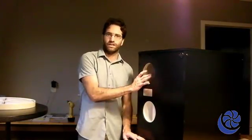So that installation dictates that you wire from the furnace control, the go signal for the fan on the furnace, to the RecoupAerator, so that anytime your furnace fan is on, your ventilation is on. And that works the same winter and summer. Anytime that your system calls for heating or cooling, it kicks the fan on, and when the fan is kicked on, you also are going to be ventilating. That is the limitation, that in that respect, you don't have independent control of ventilation versus the operation of your forced air fan.